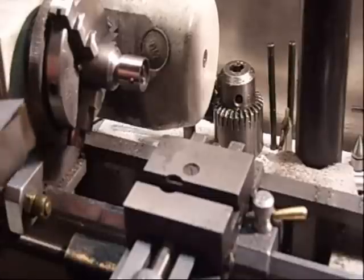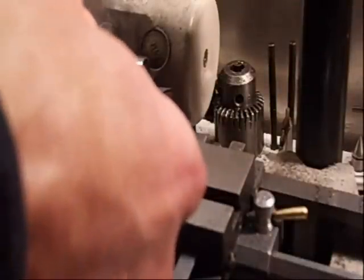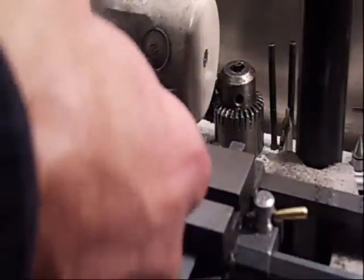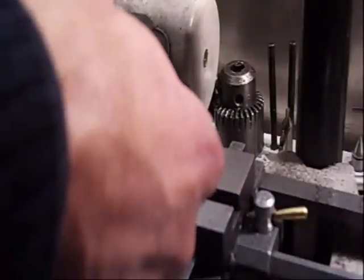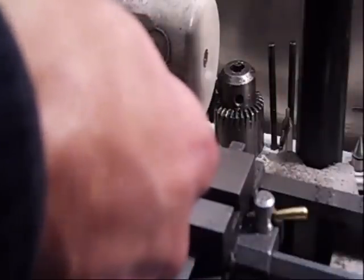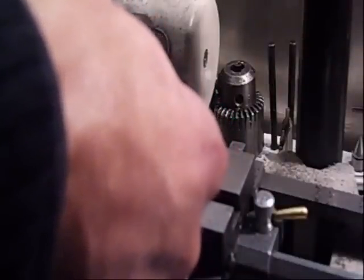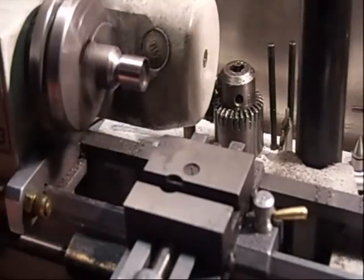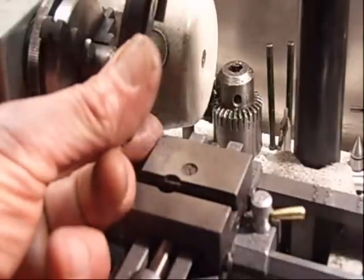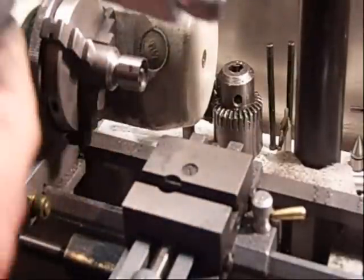But I'm almost there. Working with almost no pressure, very gently. Check again till I get the desired diameter. Check if it's the same — it is the same. I'm on 12.86mm. It should be 12.85mm.